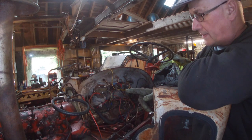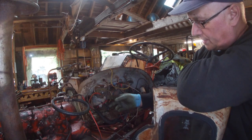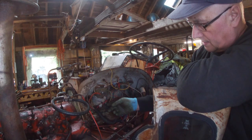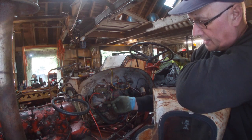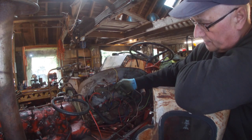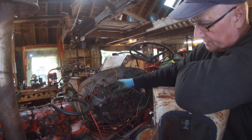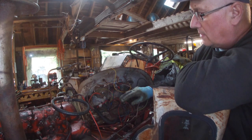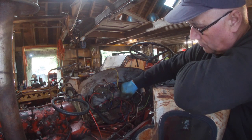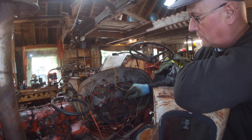Because this has got a heater, that's a starter, it's moved on to a different pole, it would be on there. So you've power in on the red there, and then into the ignition side, which is power coming out once the ignition's turned on, supplies all the greens. You've also got live power on the brown and yellow. There's various fuses in here, they're all good, I checked them all.